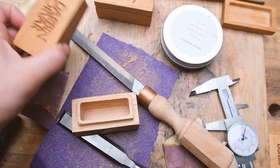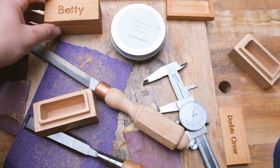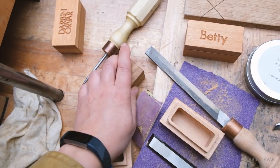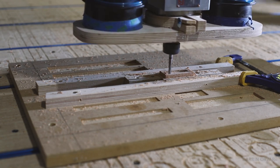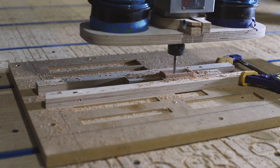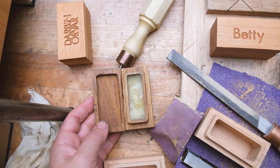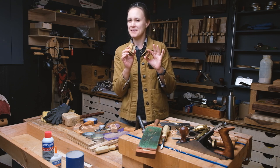When it comes to a box like this, there were a couple of things I wanted. First of all, no additional fasteners, hardware, anything like that — I wanted there to only be the wood. In order for that to happen you need a pressure fit. You can see here there's a hole, a lip, and it fits into the lid — a rather precise situation. The CNC is efficient and you could do this with any wood, even a rather hard tropical wood that would be tricky to do by hand. Here is the first test I did — this is white oak, pieces glued together. I liked the general concept, although the glue-up was an extra step and it's been a little finicky to get just right.